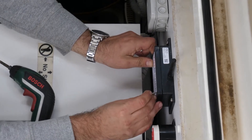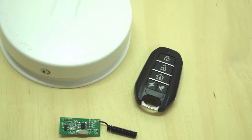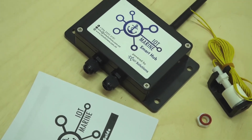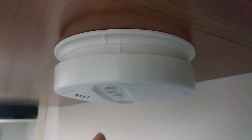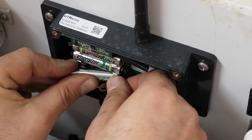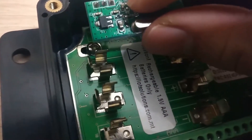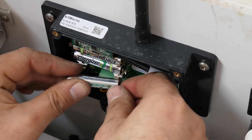Wireless package. If the hub was bought together with the wireless package, the system is sent configured and ready to go, and all the pairing of the wireless sensors can be skipped. If your wireless device came prepared to your hub, arm your system and trigger the sensors. You can test the smoke sensor and alarm by pressing its button. If these were bought separately, you will have to follow the pairing guide, which will only take a few seconds. First step is to open the hub. Turn off the hub power by removing the batteries as well as the battery banks. Attach the wireless transceiver and reconnect its batteries and battery banks, and then proceed to pairing the devices.